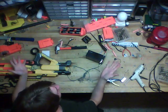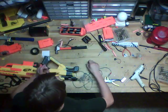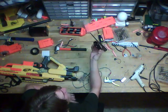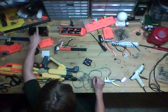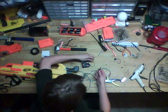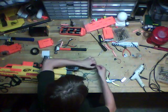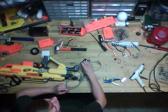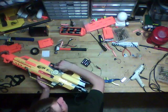That fires at a very quick rate — it's slightly faster than stock even with the new spring upgrade. That's 12 volts. Each battery is 1.5 volts, so eight AA batteries equal 12 volts, and this fires at the same speed. It just doesn't last as long, so I'll need to change the batteries often. None of these batteries are new — they've all been previously used. I've taken them out for video demonstration purposes, so this will fire a little under what it normally would because some batteries are dying. Here's your firing demonstration.